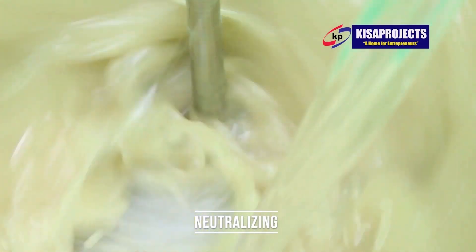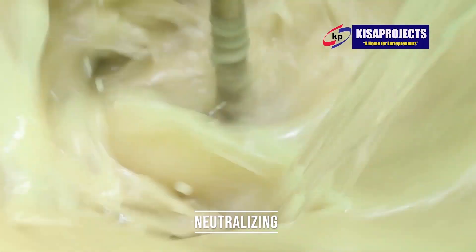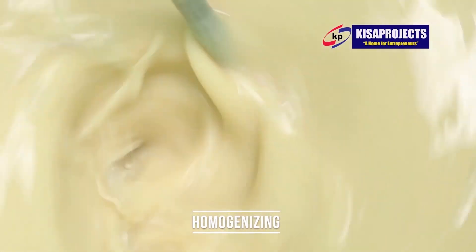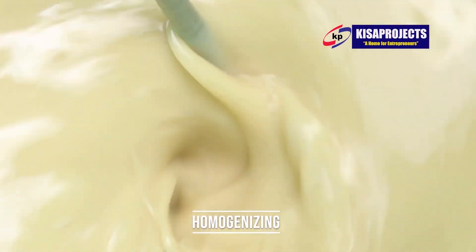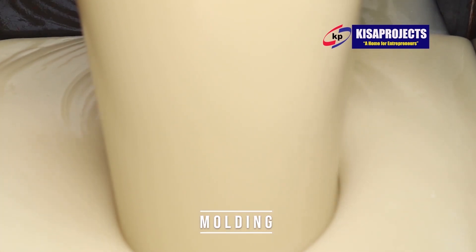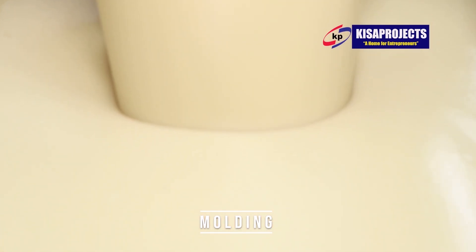Neutralizing. The main purpose of the neutralization process is to saponify the free fatty acids by an alkaline solution. Saponification simply means to convert all the acids into soap by combining them with a strong base. This chemical reaction relies on friction and self-generated heat. Through saponification, the acids and the base are neutralized.